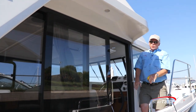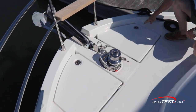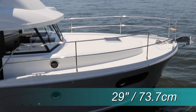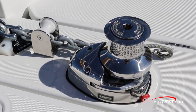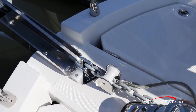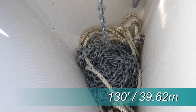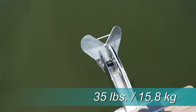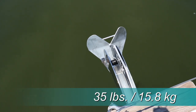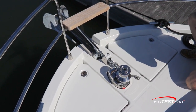Lift up the teak portion and we have the fuel fill and the dockside pump-out. Notice how this side deck is protected overhead. Fully forward, there's a 3-inch toe rail. The 29-inch rail height continues. There's a horizontally-mounted Lewmar windlass leading out through a roller. There's 90 feet of 10-millimeter chain and 130 feet of additional rope rode. Chain is secured by a lanyard. A 35-pound delta plow anchor is on a roller mounted at a recess at the forward end of the rail.